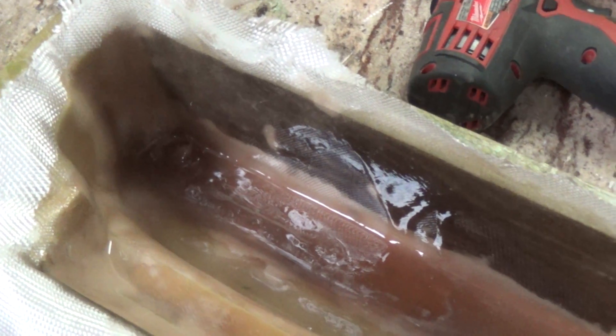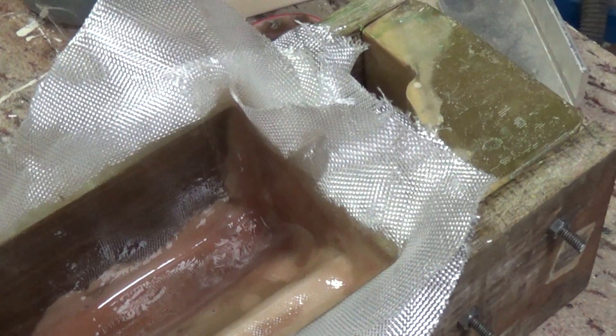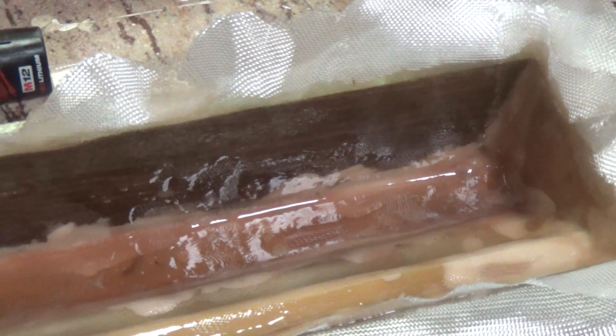Here's another trick using epoxy resin only — don't try this with polyester resin. You're liable to have a fire, or it'll thermal and set up so fast it'll smoke. I only use epoxy because I don't like the unstable characteristics of polyester resin. I know they use it in boats and under controlled conditions it's very good.